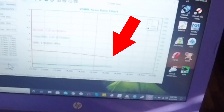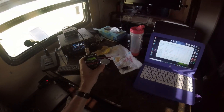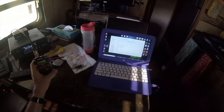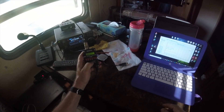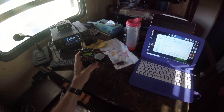Okay, it's going down. The minimum SWR is at 14.280 MHz and it's 2.25. Yeah, this little thing is one of the best tools I've bought for ham radio, especially for portable use. It's just a great little tool. I normally don't use the software — I just use the device here and it works just fine.